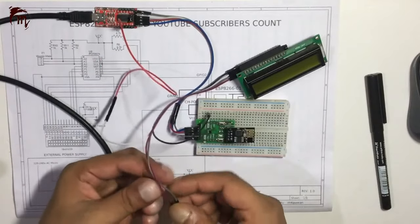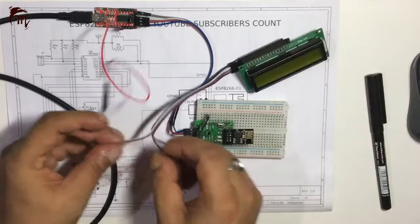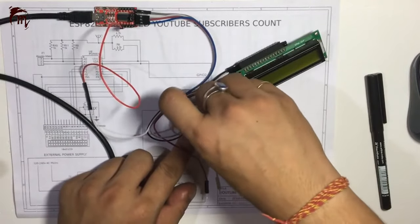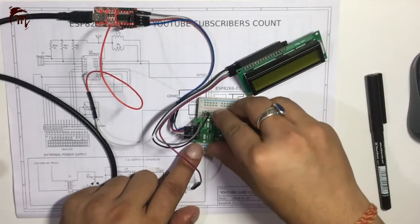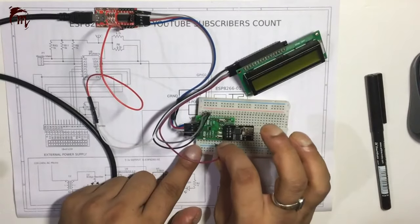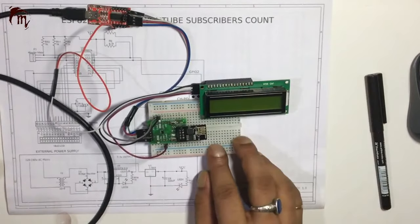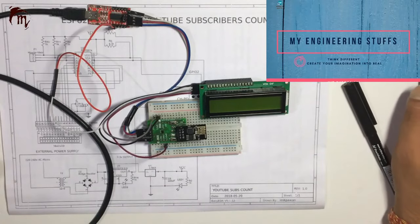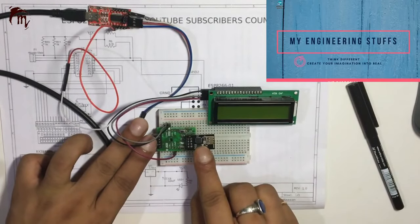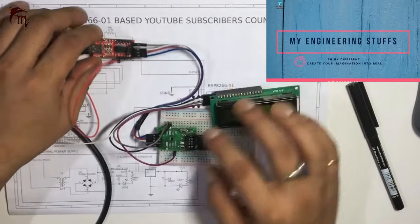Then your SDA and SCL. So SDA of your LCD will connect to GPIO 2 and SCL will be connected to GPIO 0. That's all. Now this is your circuit part. It's over. We have connected the LCD and your ESP8266-01 with your TTL converter for power supply and programming this code.